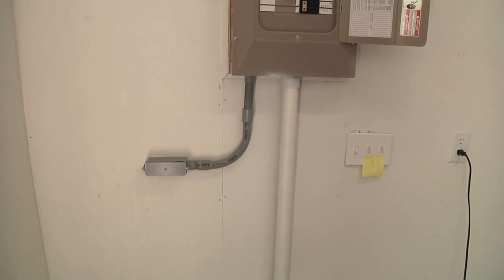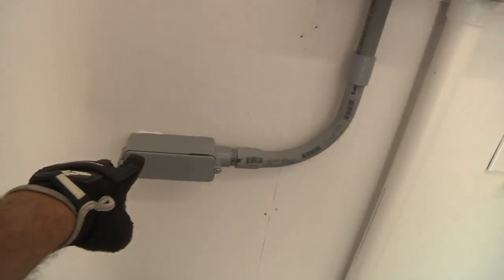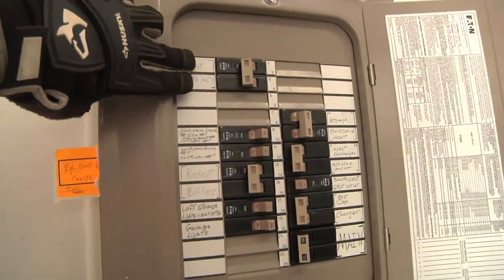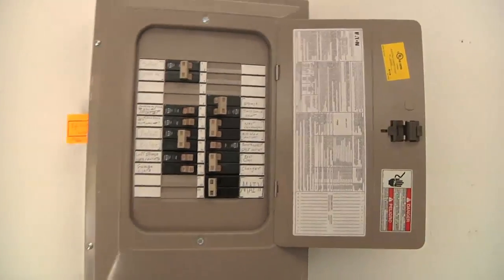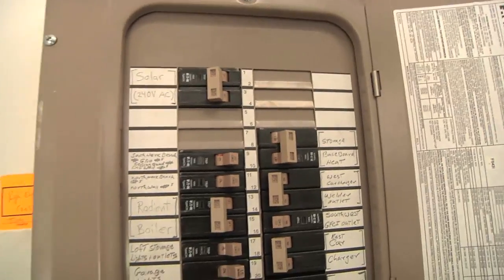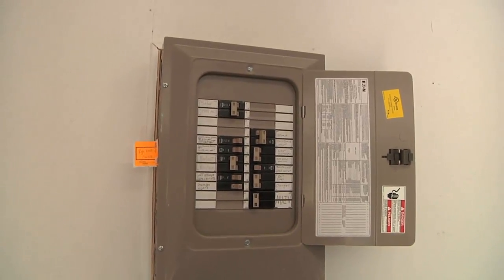Inside the garage, a piece of conduit comes straight out the back of the disconnect box, goes into this pulling body, and it just follows an elbow into the main panel — 240 volts, so it's a double breaker right here. Of course, the neutral and the ground go to the bars on either side of the box. So that's it — it's very simple, just a 30-amp 240-volt breaker, nothing else to it. I put in a call to the electrical inspector and hopefully he'll be out here sometime soon.